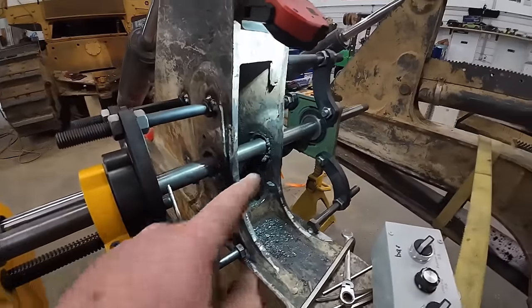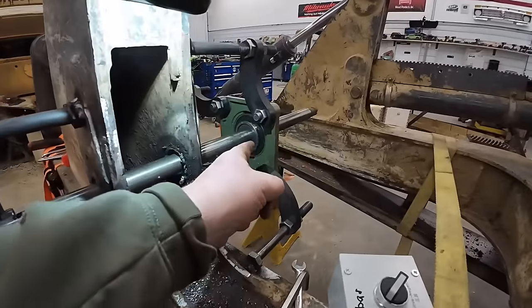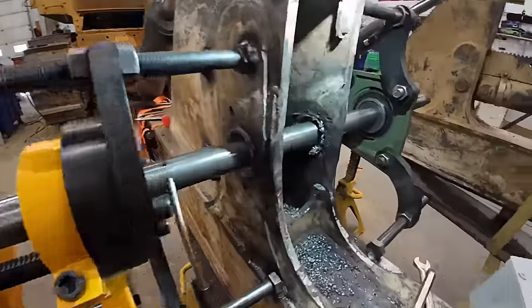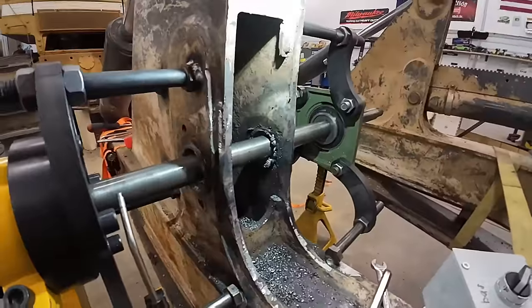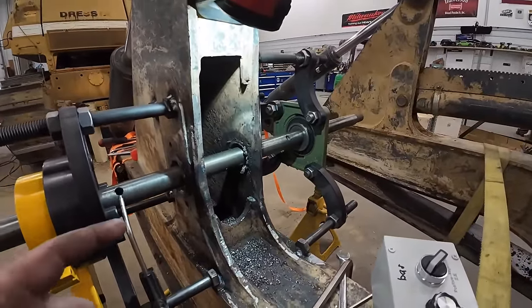Alright, you guys can see I've got an inch and a quarter of boring rod in there. You guys remember it was set up for a 55 millimeter, which is close to 2 inches. Made a little bushing wheel in there, another one in there, turned the end of my existing inch and a quarter shaft in. So we're in there cutting away. We're taking about almost 80 thousandths cut right now, 40 on each side. Should go good, one more pass. Everything's cleaned up, looking good.